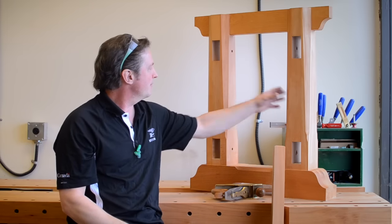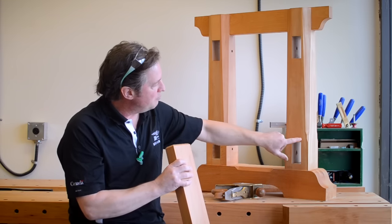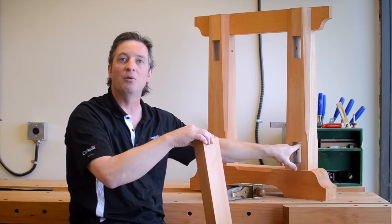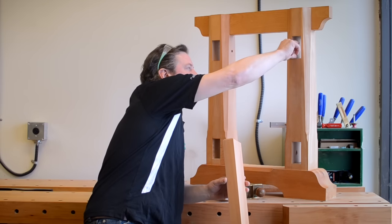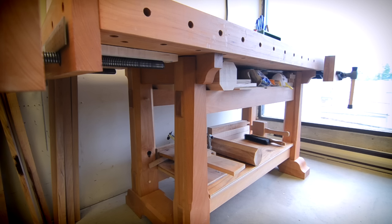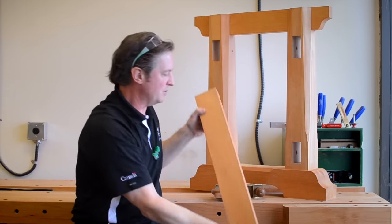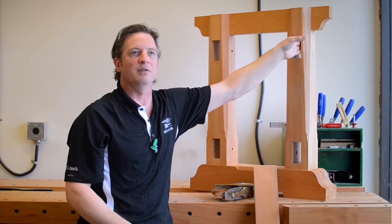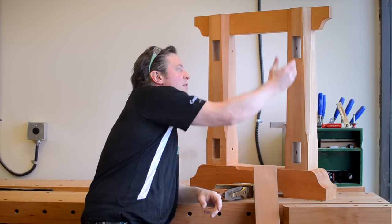The base consists of legs that are laminated out of three pieces of wood. This thickness here is exactly the same size as this hole here. When we were making the leg, we glued it up and left spaces so that the components that go across horizontally — the stretchers and rails — actually just slide into the leg itself. There's a small hole where a peg gets attached. This was a great way to assemble something this massive without having to cut these holes out, as they're really quite hard to cut on a machine. We left the holes for the mortises during the leg lamination process.